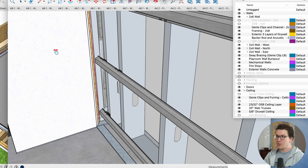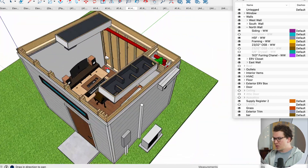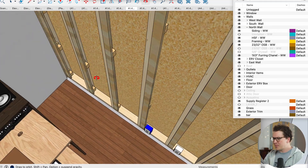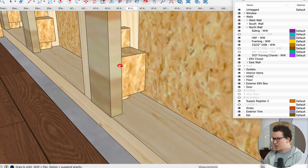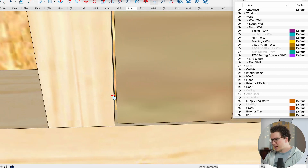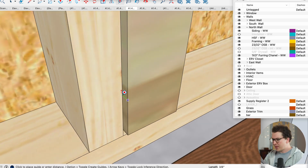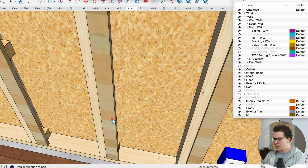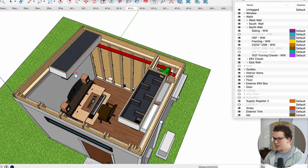Unless you're in a super small studio, a little more air gap is generally better. For example, in this really small backyard shed studio, I opted to still use the hush frame rafts — installed vertically within the stud bays — because they give just a quarter-inch bump-out, which is great for minimal intrusion while still getting decoupling in the walls. However, I did not use them on the ceiling here. I've made it a flat-out rule in our design firm to never use hush frame rafts on ceilings anymore.